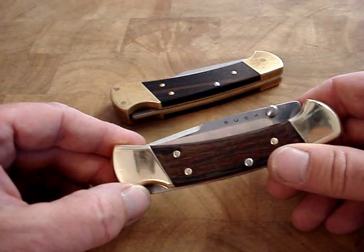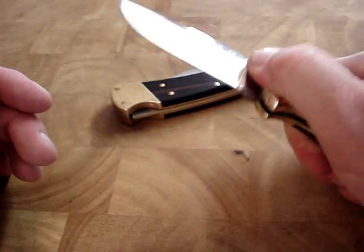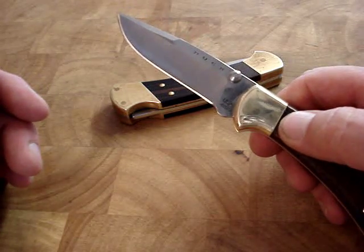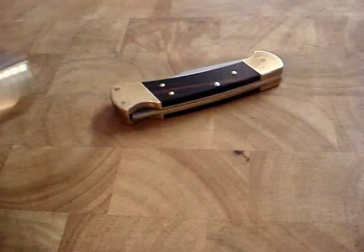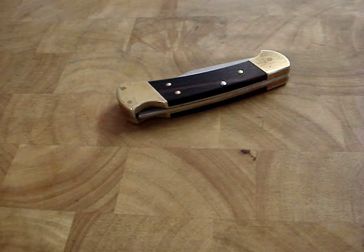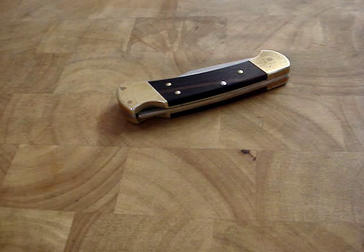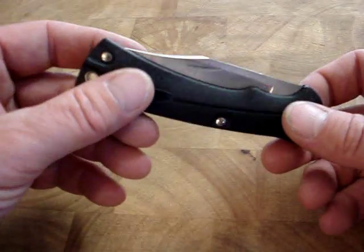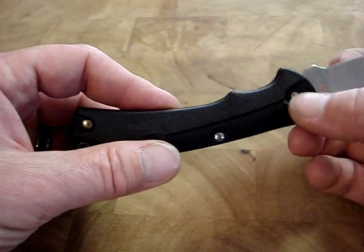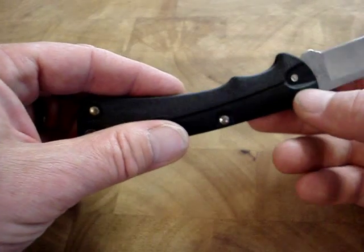Something to take my mind off the fires and stuff that's been going on lately. Buck 112, Model 482 blade. And in case you're wondering what to do with the poor forgotten handle to the Model 482 Bucklite and the old blade from the 112, you can always put the old blade in the handle — I just need to put a new pin in it. I carefully ground off where it was peened over, and you'll have yourself a perfectly serviceable knife so that nothing goes to waste.